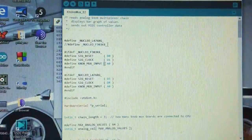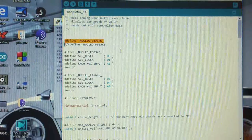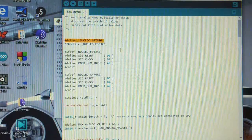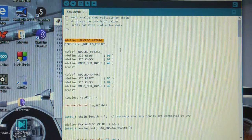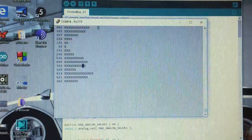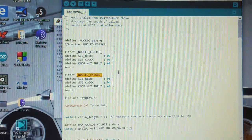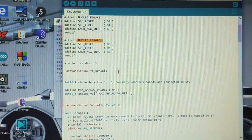So right from the top, one of the first changes I made is that I'm now running on the L476RG. I think one of the main reasons for that is because I wanted to have two serial ports. That's a huge hint about the second half of this video, by the way. What would that second serial port be for? We know that the first one is for drawing this bar graph in the console. And I found that this dev board, the L476RG, while almost identical in every single way, has a second serial port available.